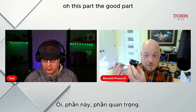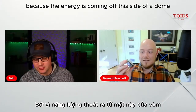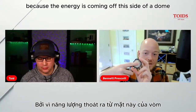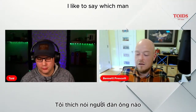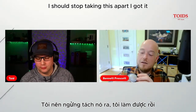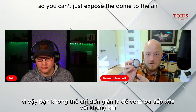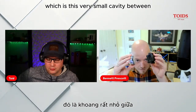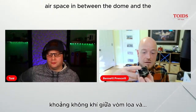The other part in hand is the phase plug — the good part. In a normal compression driver, the energy comes off this side of the dome and needs to go through a phase plug because the dome is too acoustically large. At 20 kilohertz this is like three wavelengths, so you can't just expose the dome to air and get good high-frequency response. The critical part is the compression chamber — a very small cavity between the phase plug opening and the dome, about a one-millimeter air space between the dome and the entrance to the phase plug channels.